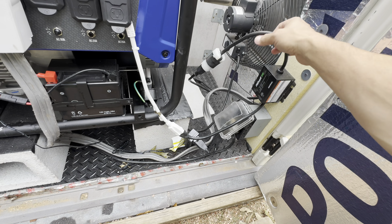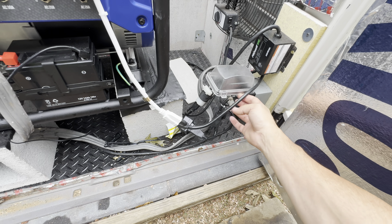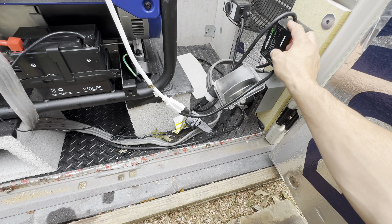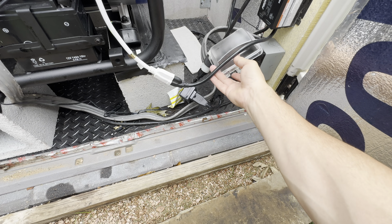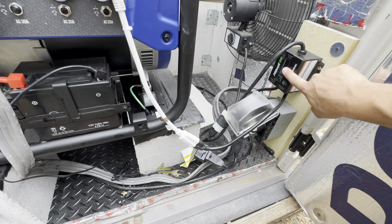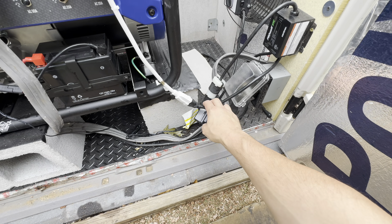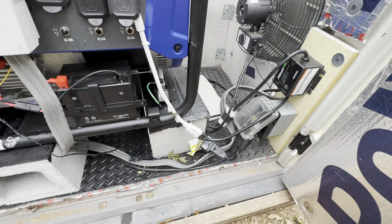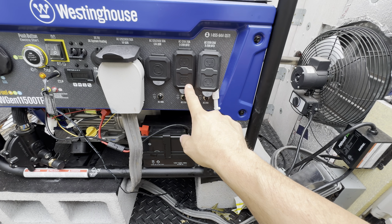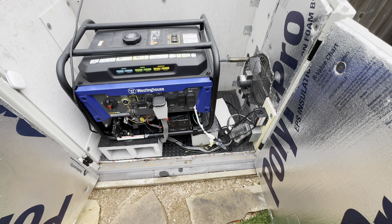I also got questions about how the transfer switch works. I have power going back to the house through the 6-3 cable, and I also have house power coming in wired to my outlet here — so I have house power here all the time. The transfer switch is plugged in here, then goes to the transfer switch, and from there I have a dual prong out. I feed the trickle charger and the fan from that, which allows the fan to continue running after the generator has turned off.